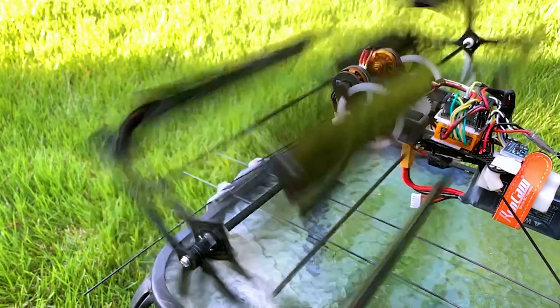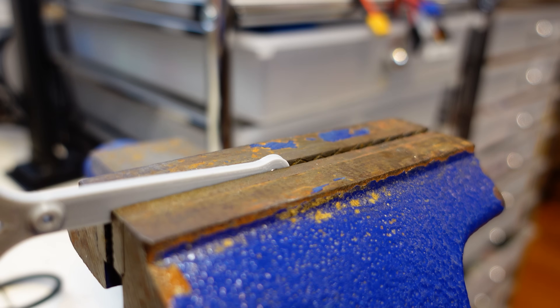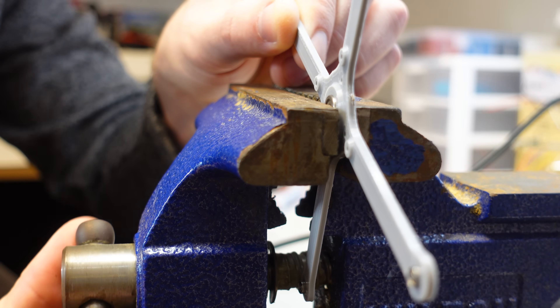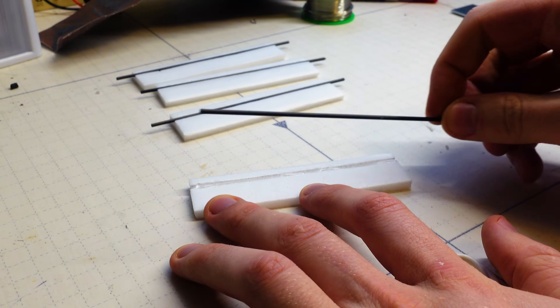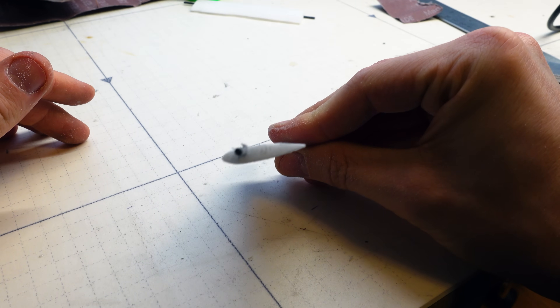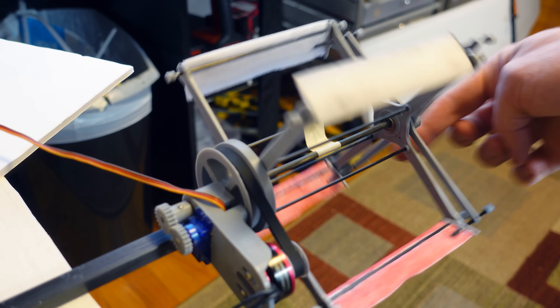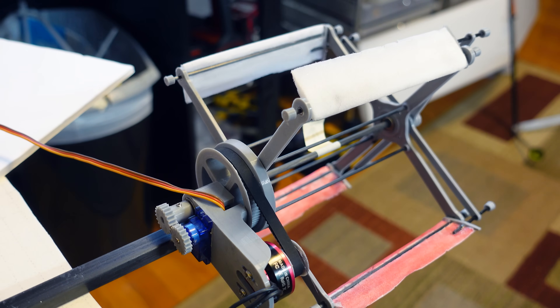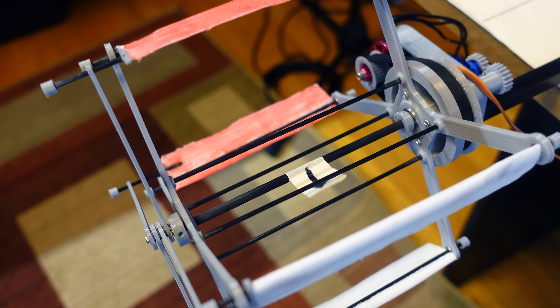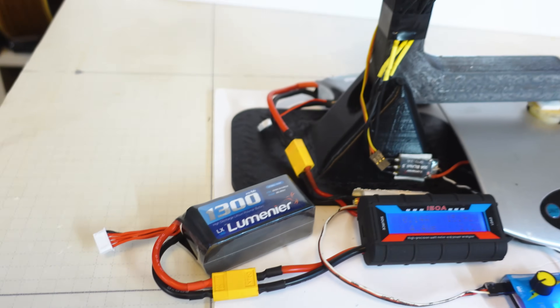Just listen to how annoying this sounds with the gear transmission. I think we can bring this noise level down with the belt drive. All of the parts were printed in solid PETG filament on my Ender 3 printer, and I used a few different size bearings press fit into the parts. The blades are hand cut from foam with a 2mm carbon spar insert, and I sanded them down to a rough airfoil shape. The parts all slide on the main 4mm carbon shaft, which doesn't actually spin. The rotor end plates spin around this shaft, while the shaft itself is geared to a servo to rotate and change the thrust vector direction. The belt drive gives a 7 to 1 reduction from the 1750kV racing drone motor, which I'm powering with a 4 cell lipo battery.